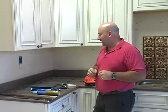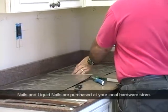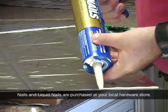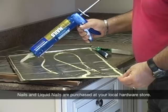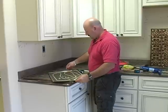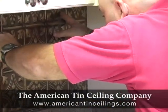Now it's ready for install. We have everything measured and cut and now we're ready to install the panels. We have two options — we can either brad nail it or liquid nail it. Starting with panel number one, you want to hit the high points, which will be right on the inside of your nail rail, all the way around the perimeter of your panel. Then release the pressure from your gun so you don't have the nail running out. You start at the bottom all the way back, and you just push and hold.